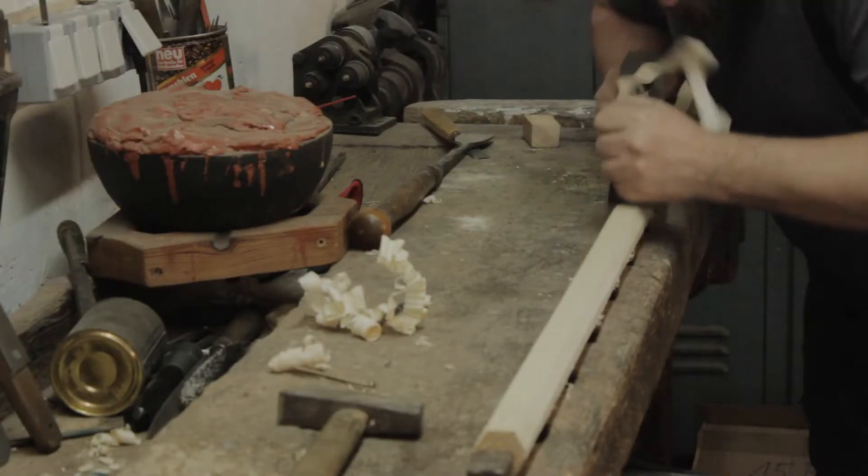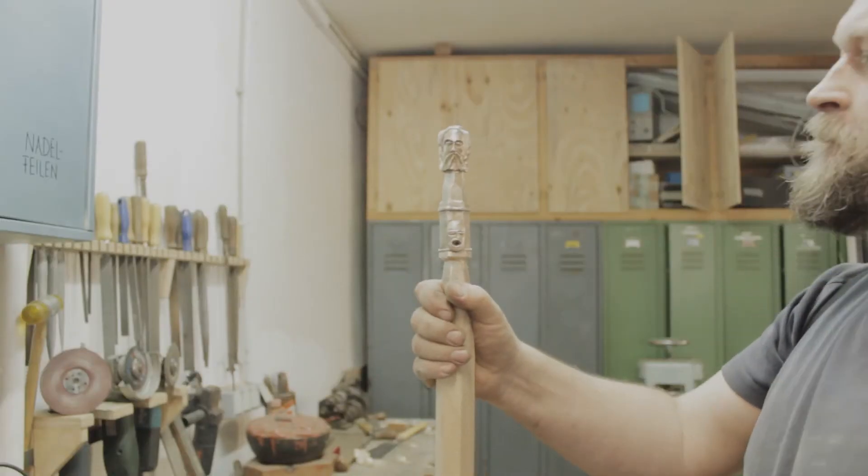It's still called the Danzig handgun. And now it's all about grinding, fettling and finishing the handgun. I will also use the chisel extensively, as this is the most important tool if you have to get rid of mold flashings and other smaller casting fins. At last we are going to make a tiller and put the handgun on top of it.